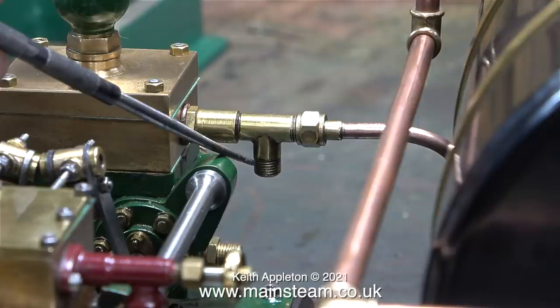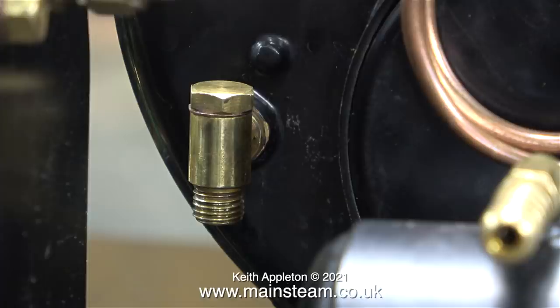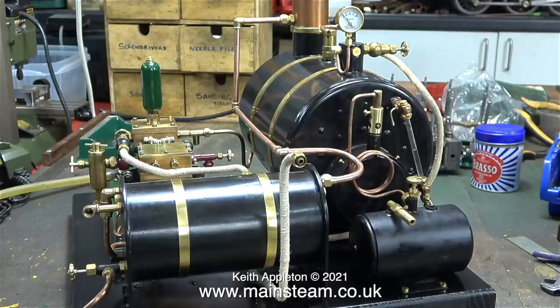The outlet from the pump is connected to the check valve on the boiler, and this part on the T-piece connects all the way from here to a valve on top of the water tank on the other baseboard — this pipe will be fitted with a removable pressure union. The check valve on the back of the boiler accepts the output from the pump via a long copper pipe, which will also need a removable pressure union. Between the baseboards there will be five water and steam connections in total. Two will use silicone rubber tubing for the exhaust outlets from the engine to the condenser inlets. There will also be an easily removable long silicone rubber pipe from the water tower to the water inlet of the steam pump. Connecting the two halves should take about two minutes. The water bypass pipe from the pump to the water tower and the water pipe from the hand pump to the check valve will need pressure unions — very easy to fit and remove.